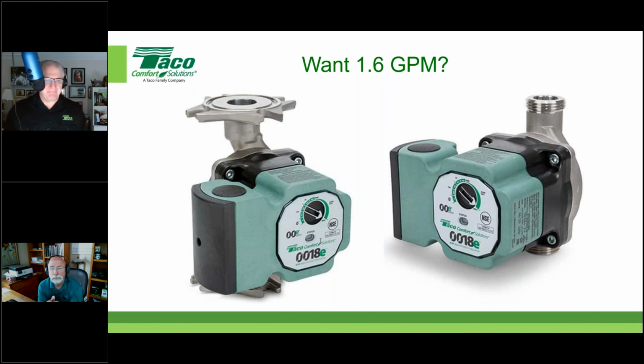Kind of like if you put your finger over a hose, right? If you put your thumb over just a fraction of the hose, well, the velocity does speed up, but the flow rate's still going to be about the same. If you put it over 3/4 of the hose, well, yeah, the velocity goes up, but the flow rate does go down. But it's like putting just your finger over just a little bit of the hose.